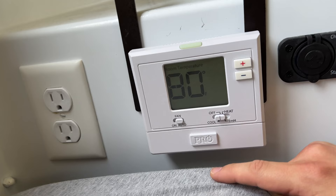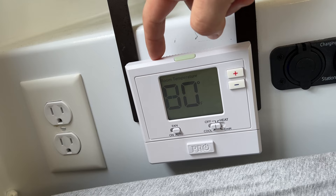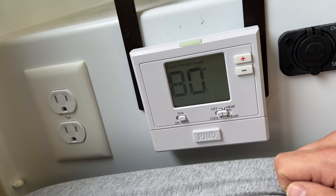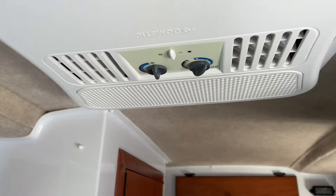The way I have this wired: the existing thermostat had a positive 12-volt wire coming out of the furnace. I wired that to the RC terminal, which is the positive. The other end of the wire from the furnace I wired to the emergency heat terminal. So now I can use the electric heat normally, and only when I want propane do I switch to the emergency heat setting — all controlled from the same thermostat.